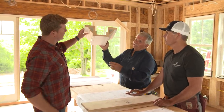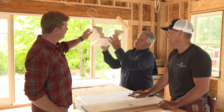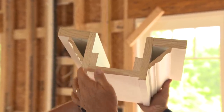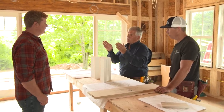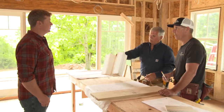Well, it's actually not really for you, but it's nice to see what it's going to look like. This is key when you're laying out a ceiling like this — it's good to make the actual size. It's made out of one-by-five stock, five-quarter stock, and crown moldings. The idea is we can take it, lay it on the floor, measure the number of beams we need from that, and then transfer all those measurements to the ceiling. Everything will be right on. Ready for layout? Yes, we are.